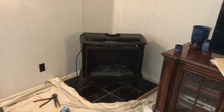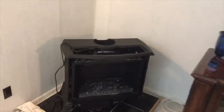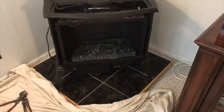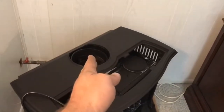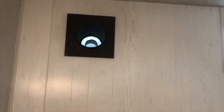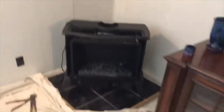Alrighty folks, we're back on site. We got the old stove out, we got the new stove in, and we got the old pipe taken down. Part of the trick of this installation is actually getting that stove set so that it looks pretty — it sits just how you want it to sit in the room and on the hearth pad, nice and square. But also making sure that everything lines up with the center of the exit on the fireplace, making sure that lines straight up with the existing hole there.